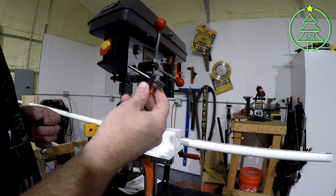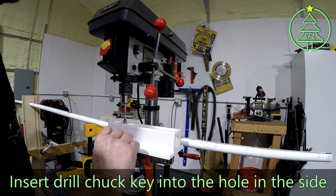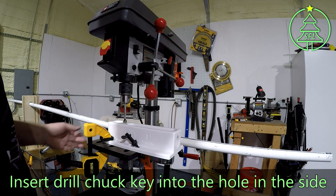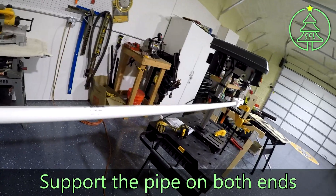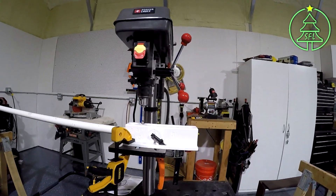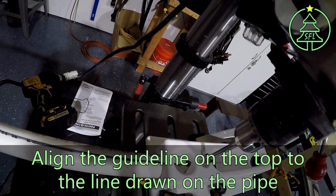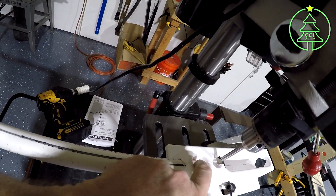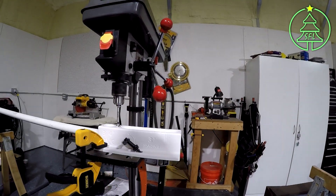All you're going to do is take your chuck key and stick it in the hole right in the middle of the logo. Just take your chuck key in here just like this. One of the things you want to make sure of is that you're pretty level and you're going straight into your jig in that direction. First thing you want to do when you put this in — you've got your chuck key here, you're going to plug this in like this. You're going to line this up with the mark on top. After the first hole, this really becomes very simple.